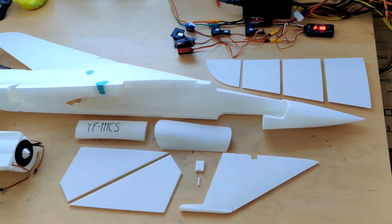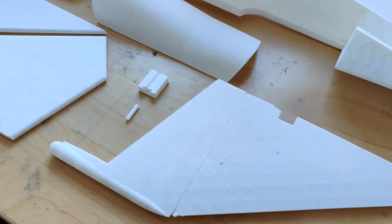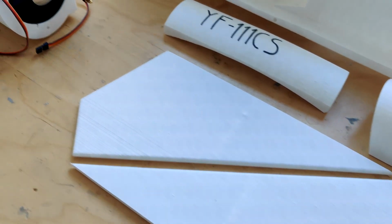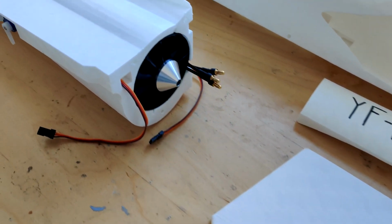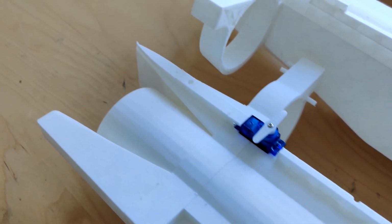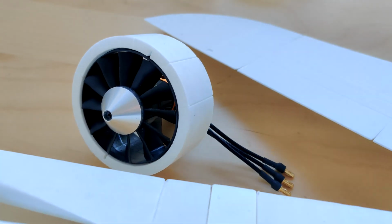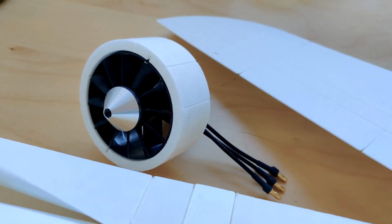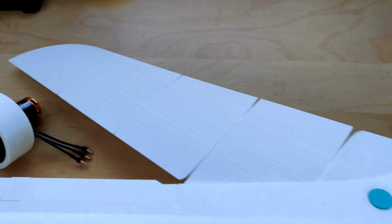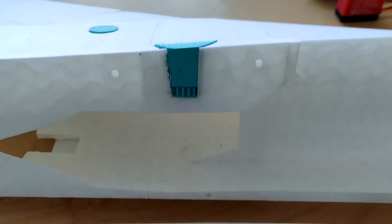However, I eventually reached a problem because the servos that I ordered arrived, and as it turns out, the dimensions that the product page showed were actually different from the dimensions that the servos actually had, which means that the cutouts that I've been designing into the model for them were too small, and they would not physically fit into the model as I've designed it.